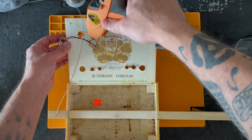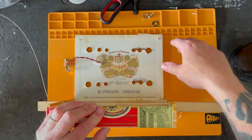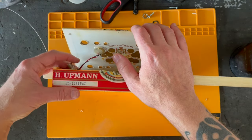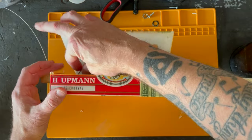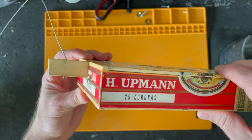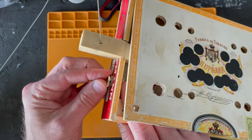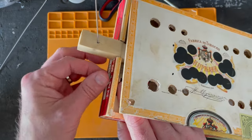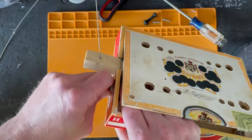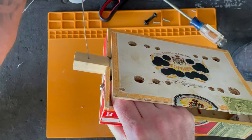So let me show you how that is done. We're going to take our hot glue gun and put a little glue right in there. That's looking like it's pretty dry, so let's go ahead and shut this and try to close it up. Now this might be the most difficult part of the whole process, because you want to shut the lid but leave enough space that you can get your hand in and feed the jack through the hole you drilled. So there's our jack — it's through. Let's make sure our lid shuts all the way — it does. Awesome. The last thing is to get the nut onto the jack. I put the washer on there, then go ahead and put the nut on, reaching through the open box to hold the jack on the inside to make sure it doesn't turn and put strain on those wires.